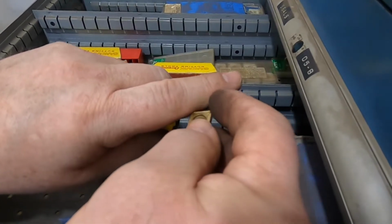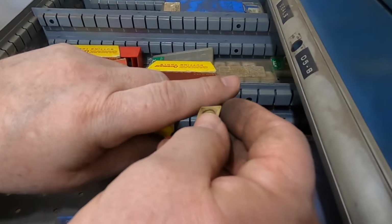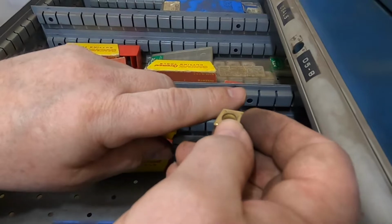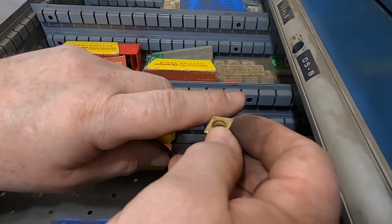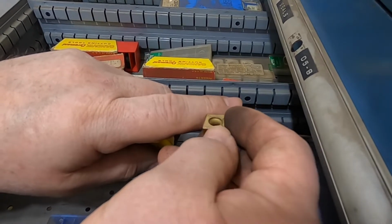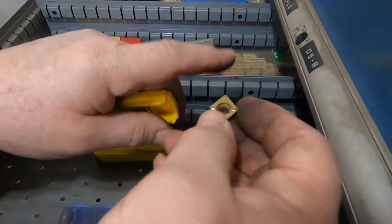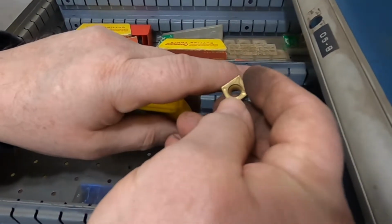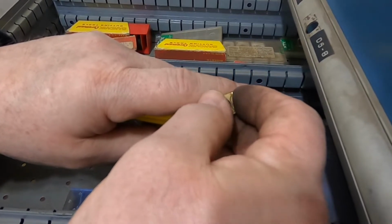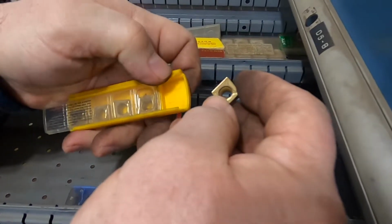And so what you'd do is rough milling on a surface. Most of the time in milling, while it's a beautiful insert on its edge here for milling, and it will hold up beautifully using this insert for a different function, in most shops it's not used because they normally want a milling cutter that will come up to a square shoulder in the smaller sizes where these are used. So while this is a positive, it's a 4 cutting edge insert. Normally, you're only using 2 in most shops.